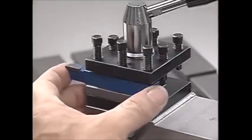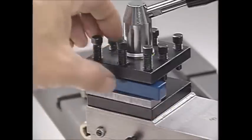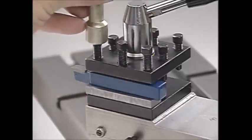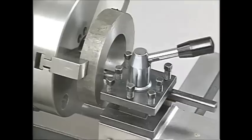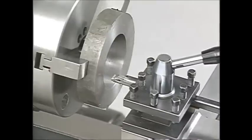The position of the cutting tool in the tool holder is very important. Tools should always be placed as far into the tool holder as possible to give the cutting edge adequate support and to reduce the possibility of the tool vibrating. In the case of a boring tool, only the length needed to clear the hole should extend out beyond the tool holder.